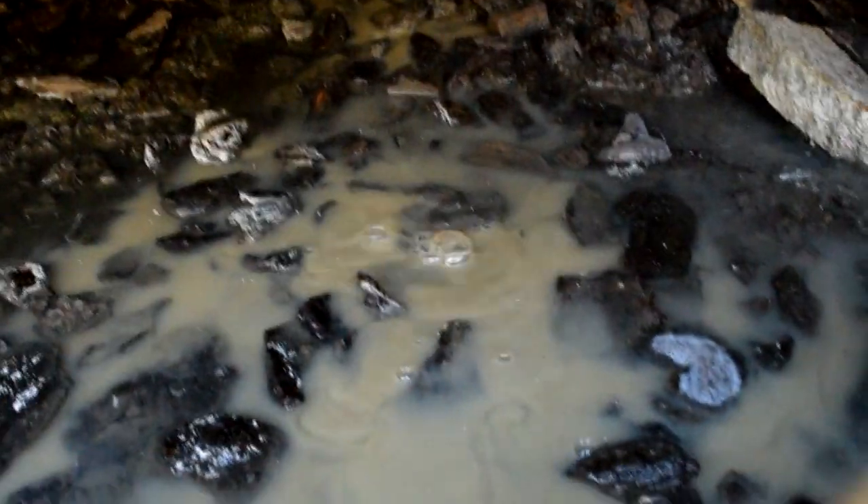Maybe this will help somebody out in the future. You know you got a water leak in your yard and you want to figure out exactly where the water leak is — maybe you can build one of these too. There you go folks, how to find a water leak in your yard without expensive radar, ground-penetrating, sonar-activating tools that everybody says you're going to need. We put air in our system — remember, air compresses, water does not. So we need to go in the house now, open up some cold lines and flush that air out, then we can open up the city line. Hope this video helped somebody out. Peace.